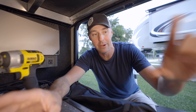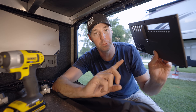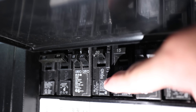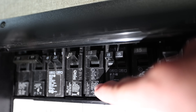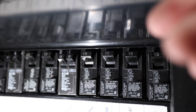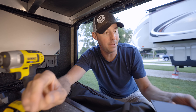The plan was to put a new 30 amp breaker in the main panel that would feed the smart distribution panel as a sub panel, and then move circuits over. The AC circuit is 20 amps, so that would come into the smart distribution panel fine. But if I move the outlets, which are on a 15 amp circuit with 14 gauge wire, they wouldn't be protected by the required 15 amp breaker. With a 20 amp breaker, you run the risk of it overheating, melting the wire, and causing a fire — those are things I didn't want.